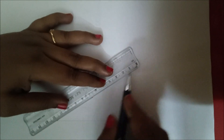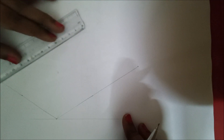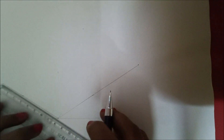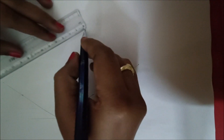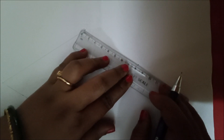At the 30 degrees direction, draw a length of 120 mm like this. Move the scale here and mark the point at 120 mm. Similarly, make the scale parallel to this line and move the cursor so that it meets the point here, ensuring that meeting point is equal to the previous point.